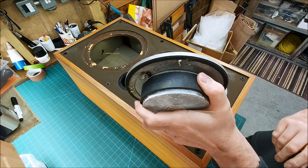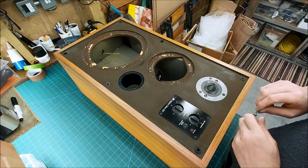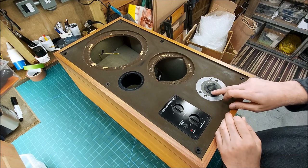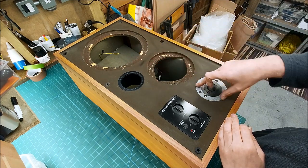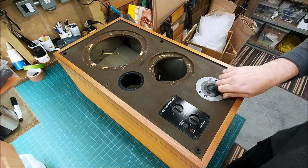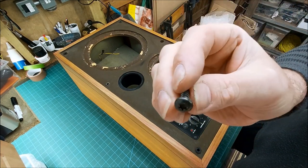This tweeter has been out before. We've got three machine screws — should be three of them, but we've only got two, and a Torx bit. I can see on the grill cover that it's been glued back on and it's a bit loose. A bit of advice: if you try to lever or pull out the front you can leave the back of the tweeter behind and pull it in half. Push these up from behind — they are really tricky and very delicate. There's a T25 in there which shouldn't be — that's a wood screw, not right.